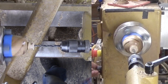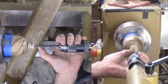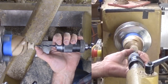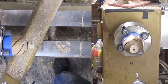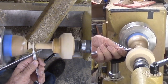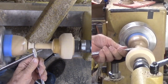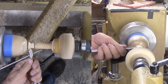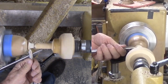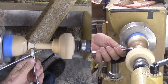Back to the goblet bowl. It is mounted to my chuck with pins similar to what I showed in a video a couple weeks ago. The difference is that these are shorter, use flanged button head bolts, and have a ledge at the base that the goblet can sit on. While I 3D-printed mine, these are easily turned. Some people responding to that video also insert them into vinyl tubing for padding. Now I need a mortise for the stem tenon, then shape the bowl bottom feature before sanding and applying finish.